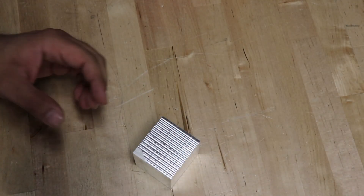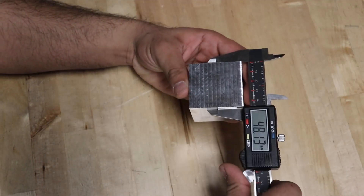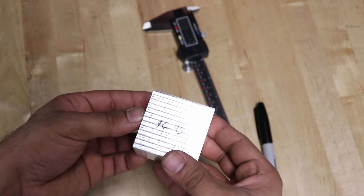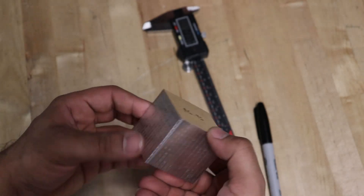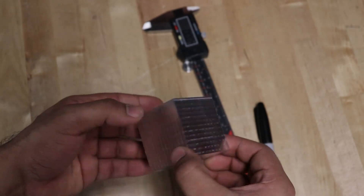After that's done, I'm measuring the thickness of each dimension of the aluminum block and noting down the size of each one of its faces. That way I can probe off the top and cut at the right depth by changing the top height in CAM. I only have to do this properly once, since now we're cutting at the final heights so they should all be the same.